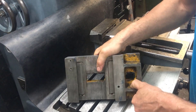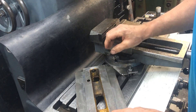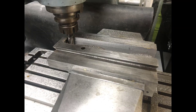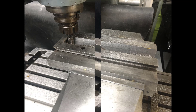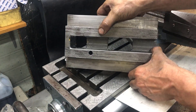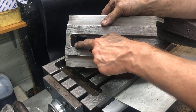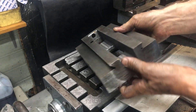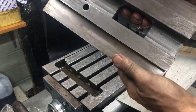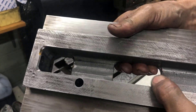I will mill it off to get it a little bit better, so that's a product in itself now. Once I finished, I took out here with an end mill, and then I finished off with a ball nose cutter. We kind of blended it in here - I think that is an improvement over what was also around the corners.